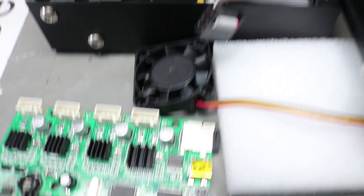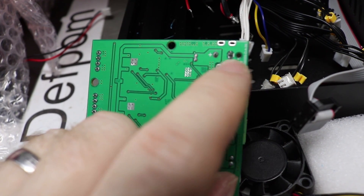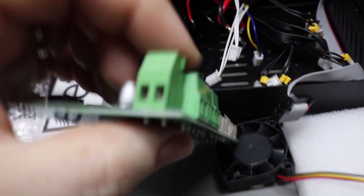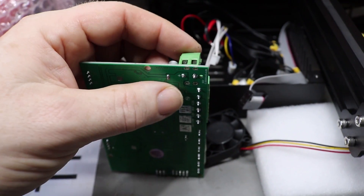So I'm going to modify this circuitry and make it so that fan stays on all the time. But when I pulled it all apart, I found here - look, if you can see it on camera - those are the power connectors for the main system coming in, and they are broken. This connector's just wobbling around. Those two joints are broken.